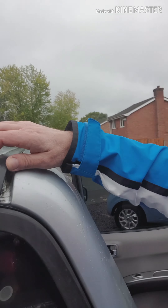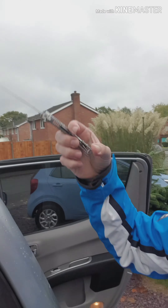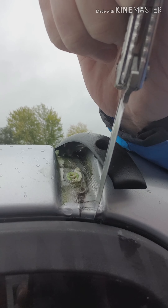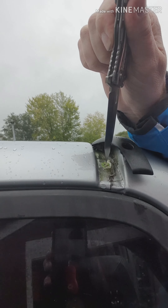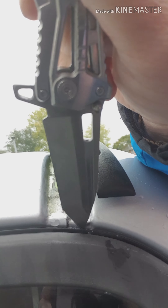So you've got a hole in there. And just to top off that stupidity — if yours is like mine — there's a seam here that's lower than the rest of the seam, so it lowers there. I would say the leaking is in that screw hole and in this seam. You can actually pull that seam back — you can get a knife under it there. Over here you can't, but this side I can put my knife under, so I'm going to pull that seam back.